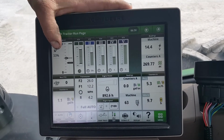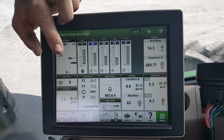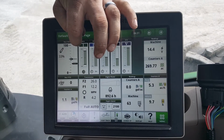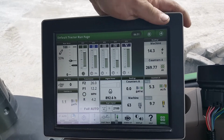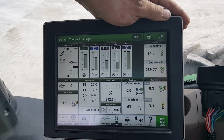Now, the rear hitch also on this tractor, with it being a 3-point hitch, you just want to lower it all the way to 0 when you're in plant position and raise it up to 100% when you're going down the road. Now in summary, setting SCVs and hooking up the back of the tractor should be easy for your upcoming planting season in 2018.